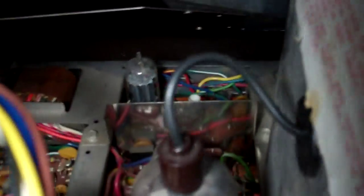The entire IF is all solid state — in fact, I believe there's one IC back there for the sound processing. The sound output is right there on that heat sink, solid state. We have a few tubes: a video output and the RGB output triode right there, the 6FQ7 in the back which is the horizontal oscillator, the 6GF7 right there which is the vertical multivibrator, and the 6GE6 horizontal output and damper.